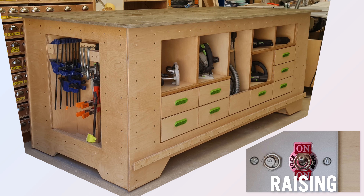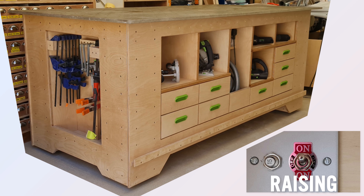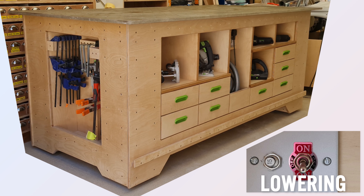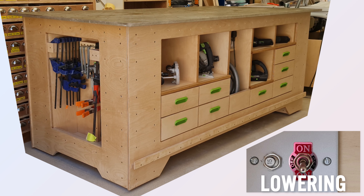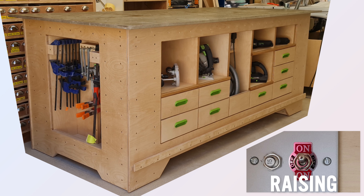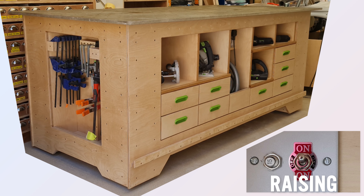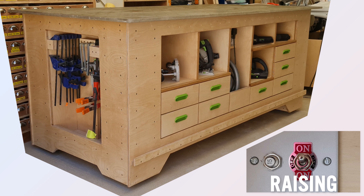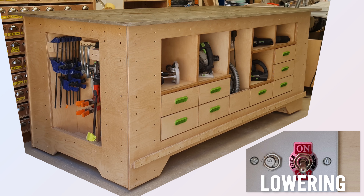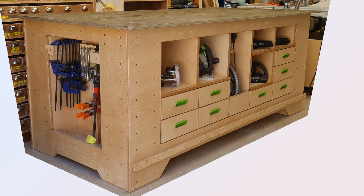And finally, the key feature for me: the lift and shift function, allowing me to lift and drop the bench with a finger switch. Utilizing a 20 amp, 12 volt sealed lead-acid battery constantly maintained by a small battery conditioner, the four 600 kilo-rated linear actuators in the legs are simultaneously energized and lift and fall in reasonable synchronicity. The actuators stop drawing current at the end of their movement, meaning just flicking the switch is all that is needed. The bench height can be held anywhere on the travel by switching the actuators off, but sitting on casters the bench is pretty unsteady for working on.